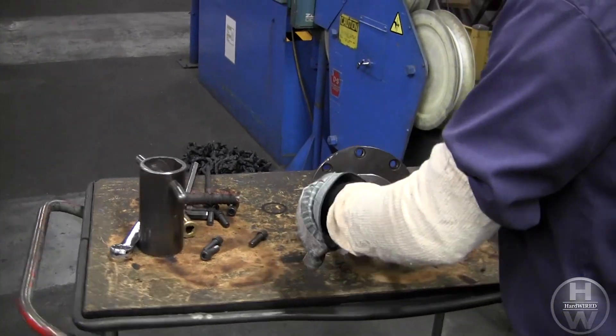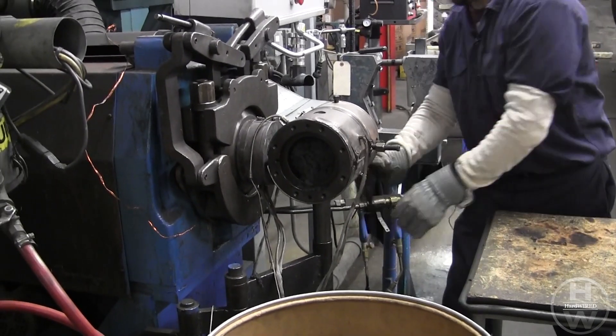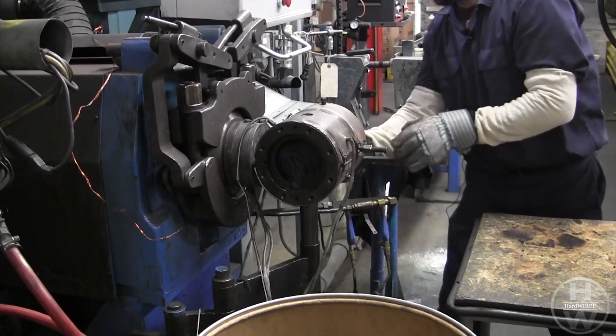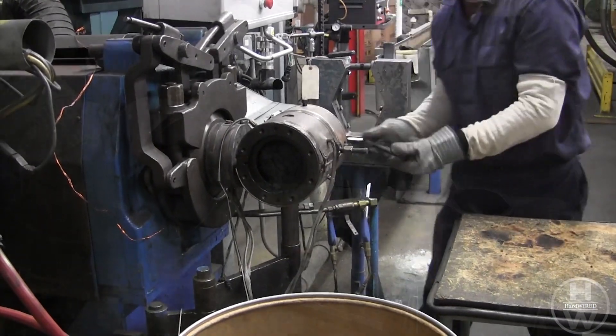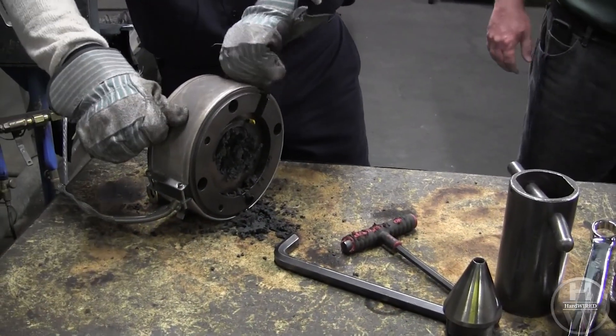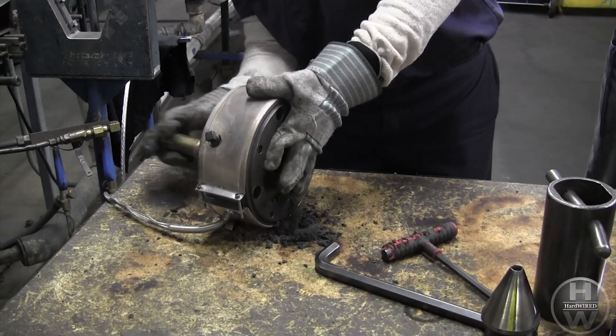So this process actually allows for self-cleaning. At the front of the crosshead, the die block is removed. It contains the sizing die. These components are cleaned next. At this point, you can see the compound is still in the die. The die is removed so it can be scraped clean.